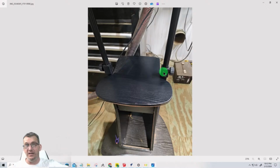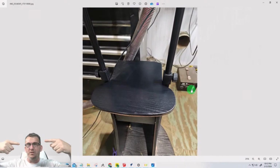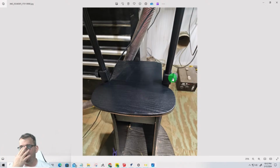This is now the actual podium here on the screen is metal, right? That's a metal rod. So, tightening the bolts into it to put friction pressure on it to keep it from dropping, it's not really going to damage that rod over time. But, with the wooden dowel, depending on how much I tighten or torque, I'm going to be kind of poking dimples into that dowel over time, right? And that might not be a desirable outcome if you want this to have a little bit of longevity. So we could take that 1 7/8 inch dowel and we could lay it out.